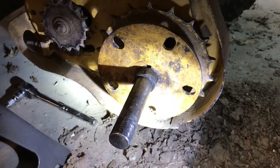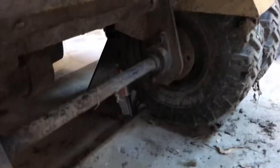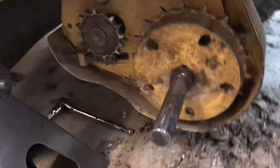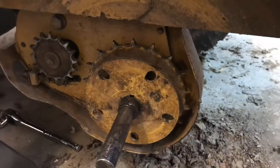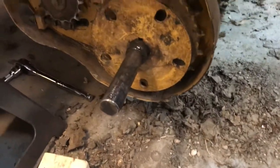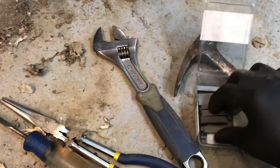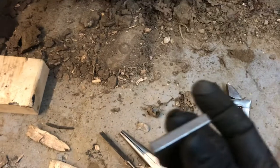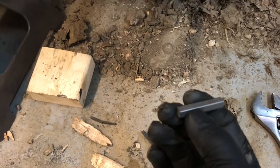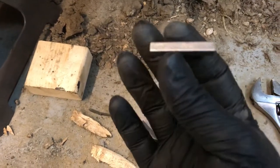Like I said, anytime we'd try to climb the trailer or they'd be mulching and go up a bed of chips, that whole shaft right there with the tires — that shaft and the tires — they'd just spin, because inside that keyhole is a key. It's a quarter inch by quarter inch by one inch key — that's the size of it. I called the manufacturer and got the size. This is just an assortment of keys, and it's one of these right here. This one is an inch and a half, so I did cut off a half inch. It doesn't have to be perfect — it's quarter inch by quarter inch square and one inch long.